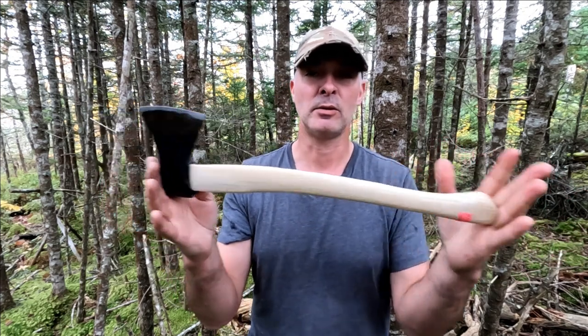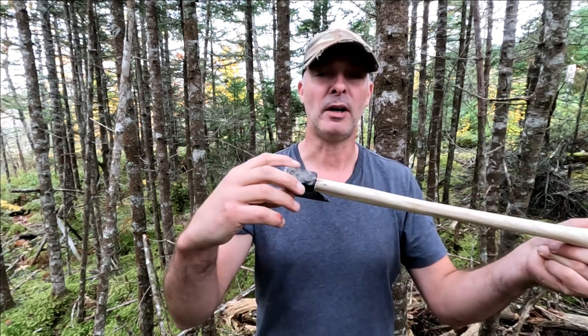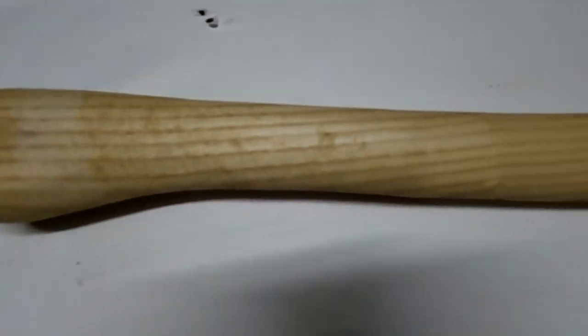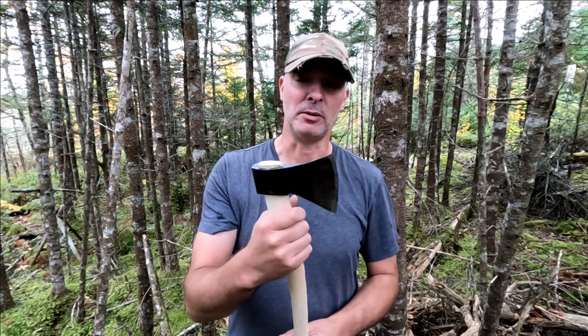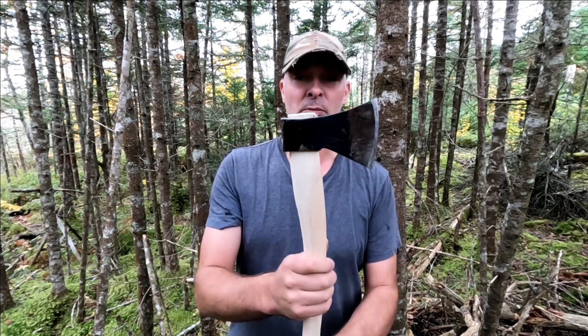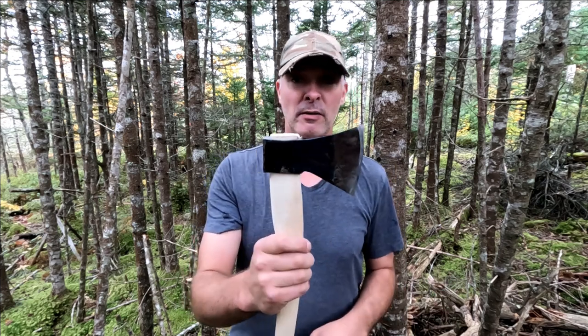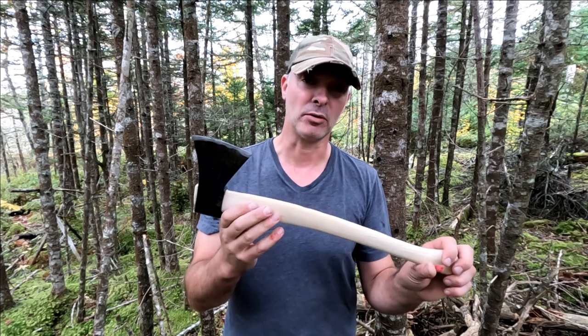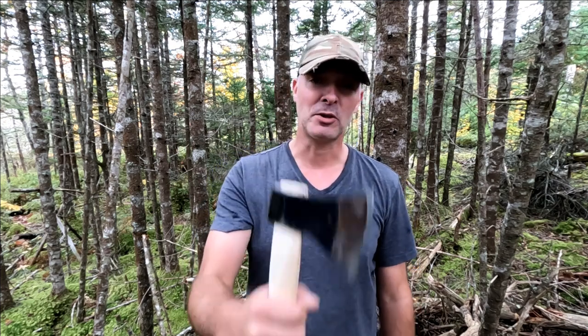Anyway, there you have it — a cheap four dollar axe turned into something a little bit more useful. It took a little bit of time, but now I've got this axe for as long as it holds up, which if I'm lucky will be the rest of my life. Just needs a little bit of linseed oil, let it sit for a week, and you'll be ready to rock. That's one way to take a cheap axe, put a decent handle onto it, put a proper edge onto it, and you've got a better axe. Sure, you can spend $50, $80, $90 on an axe right out of the box, but with stuff like this you learn all these little skills and save a few bucks. For hatchet work, this is all you really need to do to take a cheap hatchet and really improve its utility. Hope you found that interesting — if you did, please like, share, subscribe. Until next time, enjoy the outdoors on the cheap, thanks for watching.